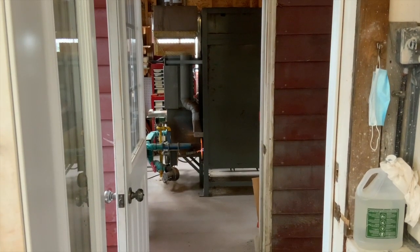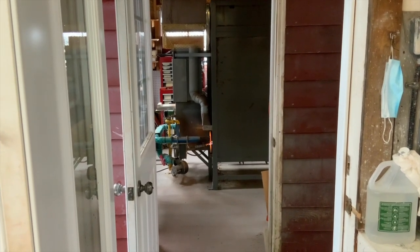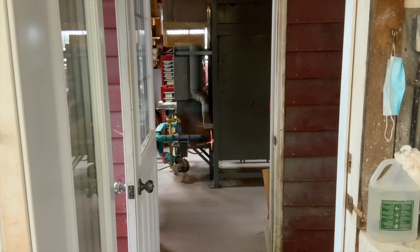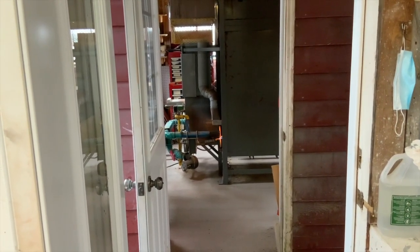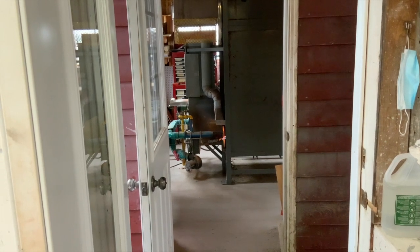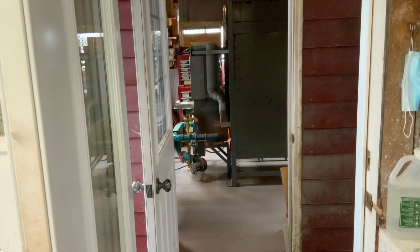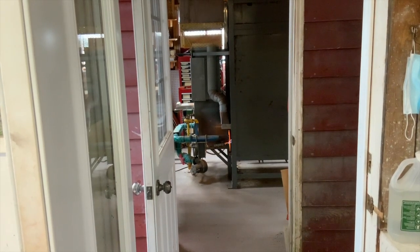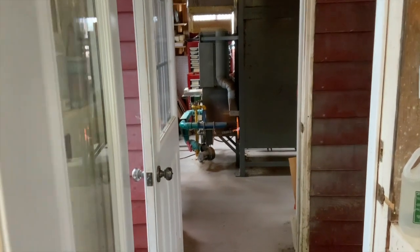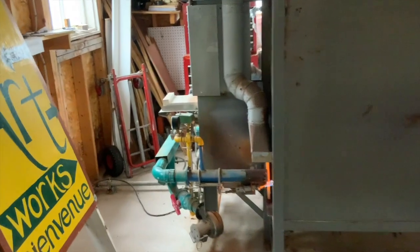It's 9 o'clock in the morning. I turned the kiln on at 7 o'clock this morning, and I preheated it at 7 last night for an hour. I turned it off because I don't like the pilots running overnight — it's a waste of gas. At 7 o'clock this morning I turned it back on. It was at about 75 degrees Fahrenheit this morning. I've got one burner going with both pilots on. The gas is at almost zero but that burner is still putting out enough gas that the temperature should rise.